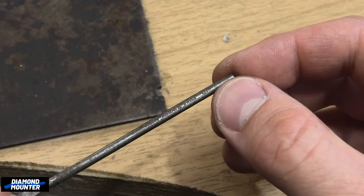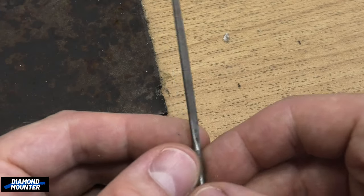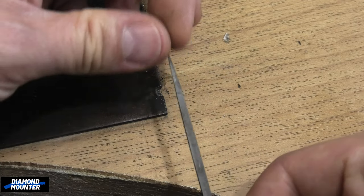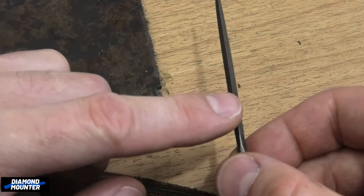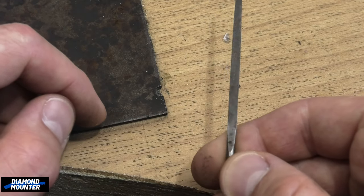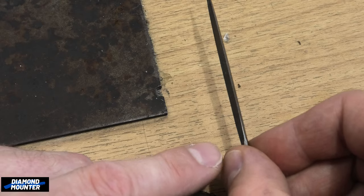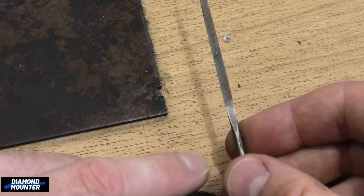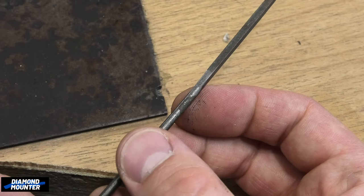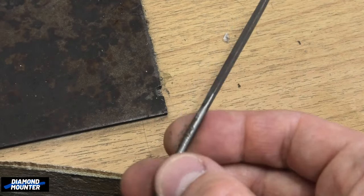It's flat with teeth down one side - had teeth ground off the other side. You can buy them like that. Being flat on the end with a perfect right angle is really good for going across the top of collets and between four-claw settings. This one did go to a point and I snapped it off. I actually made a bigger version, and the bigger one is probably more useful. This cut six - Swiss made, given to me at the start of my apprenticeship - has been really really useful. Such fine teeth make the corners so sharp, cutting into solder at the bottom of a claw and tidying up with a rubber wheel. Having at least one or two really fine-toothed files - square or tri-square - helps make your work much neater.